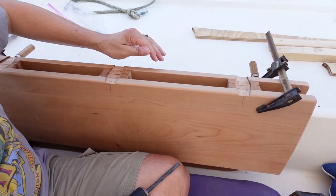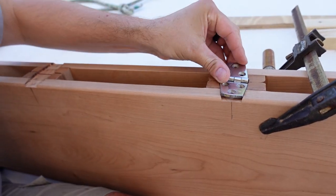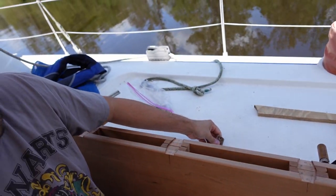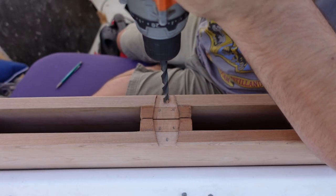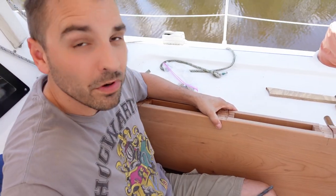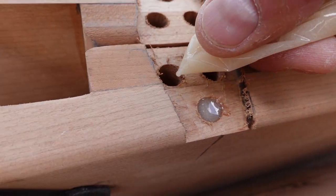The next step: I've gone ahead and marked the holes for the screws — you can see where they line up. We're going to drill them out oversized and then pour them with thickened epoxy. This technique is called 'drill, pour, drill.' The idea is that when this is finished, I don't want water getting into those screw holes and rotting it from the inside, so the epoxy pour gives a little more protection.